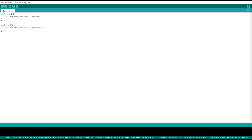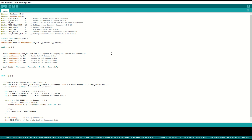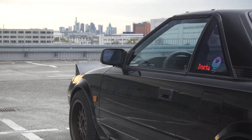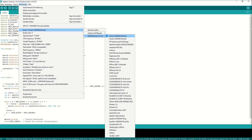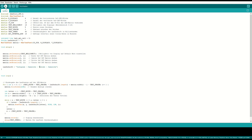Once that's done, I used a code I found online — there was a COVID live ticker which used similar code to what I needed, and I modified it a little bit. Here you can see it shows Instagram, JumoWorks, etc. — this is what the slider text will display at the end. If you can't copy it, I've tried to put everything in the description. Then go to your board settings, look for the generic ESP8266, and when you plug it in, the port appears in black instead of gray. Then you can go to Upload, connect a USB device for power, and that's it.